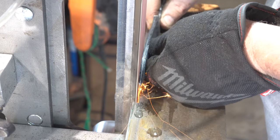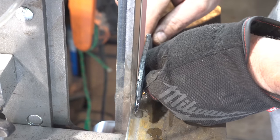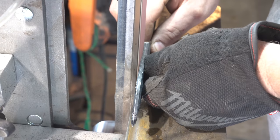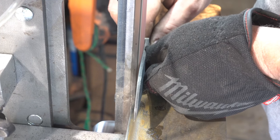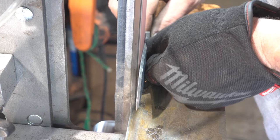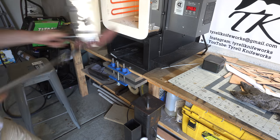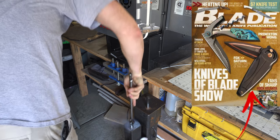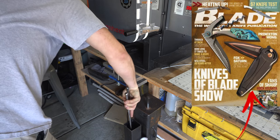The other question I get all the time is: is this really going to be a strong enough knife? You can't weld copper. Well, we're not really welding. Welding means you're melting both metals together — here we're more brazing. And brazing is over 70,000 PSI in tensile strength, so the copper bond is very strong. Plus we have a high carbon core all through the blade. Another interesting tidbit: the Blade Magazine knife of the year for this year — overall knife of the year — has copper in it.